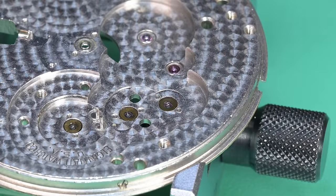We'll bring this back to 12 o'clock and check the position of these hands — that looks pretty good to me. Now we can install our seconds hand, making sure the post on that seconds hand is on that fourth wheel pivot. Just very light pressure — what did Bob Ross say? 'Two hairs and some air.' That's the amount of pressure I'm trying to achieve when pressing that down.